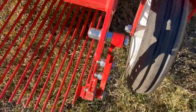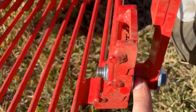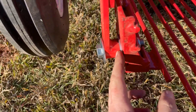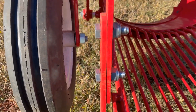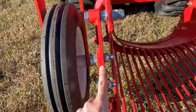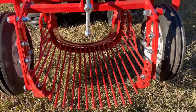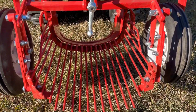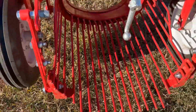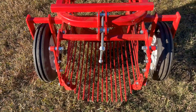Then on the back at the very bottom, I put two washers on here — there were no washers. Then I put two washers here, and this one was really scrubbing; I think that's where my squeak was. I found out from the factory they had this kind of caulking-it-in deal on the other side, and now it's perfectly straight. I think it probably added a couple thousand hours of extra run time on this unit just by putting in $10 worth of washers.